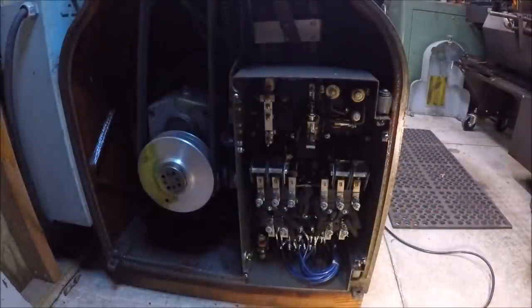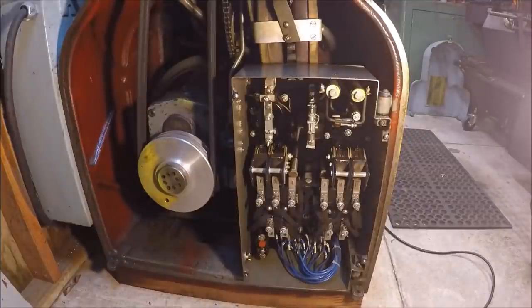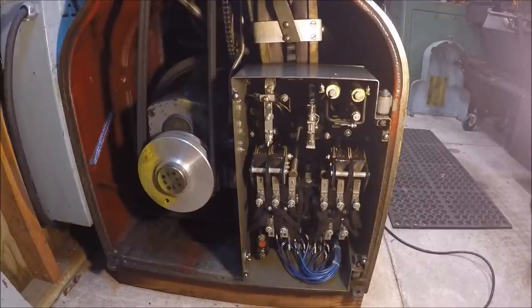This is the back of my 10EE and I've had a problem where the unit will, when shifted to run the spindle, it runs and then if I shut it off it won't run. Through some help from Monarch's service tech — I wrote back and forth to him — he said he thinks it's a sticky AP switch. Then I talked to my friend Alex, who really knows these machines, and he gave me a little hint on how to look at it and diagnostics.